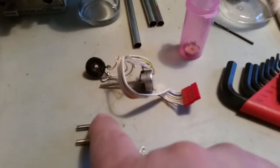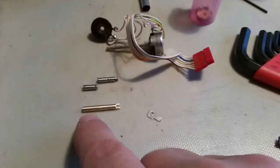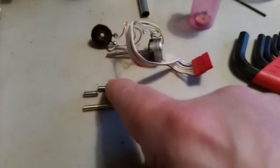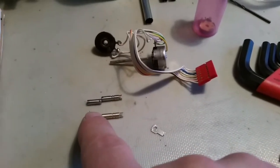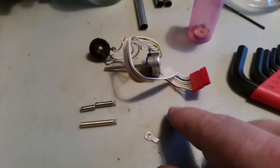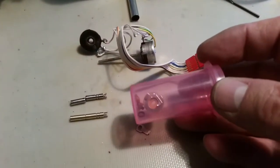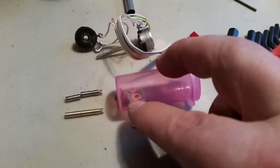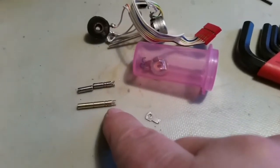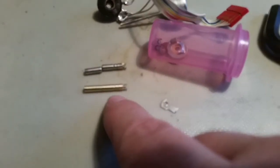The shaft was broken right here. Some of you guys know that I have a lathe from some of the other videos I've done. I went ahead and built one on it to replace this one. This one's actually brass, and this one's made out of stainless steel. What I figured I would do is feed it through the actual little support piece in there — that's the brownish O-ring thing. This goes on the back side, and then crimp that over. And if it doesn't crimp real good, then because this is brass, it'll take solder.